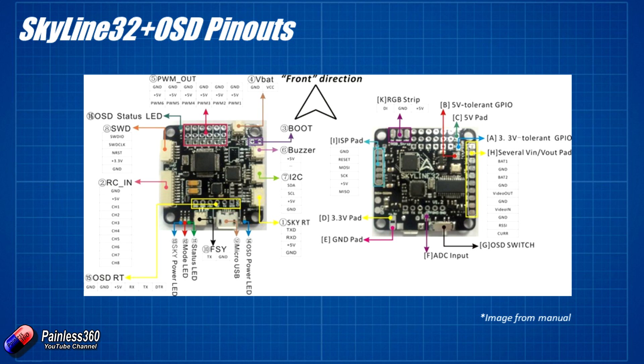This is what the board looks like — here's the top and here's the bottom. A lot of the pinouts are very similar to what you'd expect on a Naze 32, Flip 32, or Skyline 32 style board. They have the RC ins, the PWM outs for the ESCs, and loads of other ports. We're not going to go through this in tons of depth — if you really want to know how all these parts work, go and watch the Naze 32 series. Let me simplify the image and just talk about the things you need to get it flying, connected to your multi-rotor, and into your FPV kit.